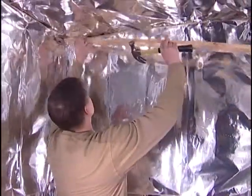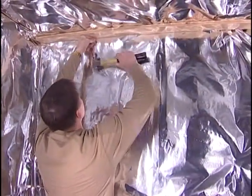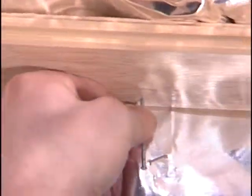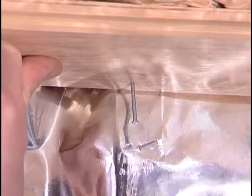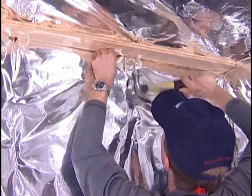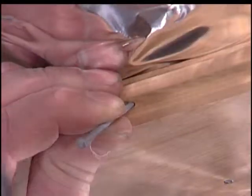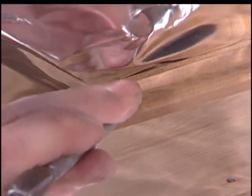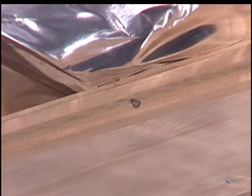Using ceiling boards marked with 1 dot, install the first board on the ceiling joist, with the smooth side facing out and the groove facing the wall. The first ceiling board can be face nailed at the edges, as the 3/4 inch wide ceiling molding will cover these holes. Attach the board using the 5-penny nails provided. Position the nail at a 45-degree angle to where the base of the tongue meets the board. Nail to each ceiling joist. Countersink each nail using a nail punch.